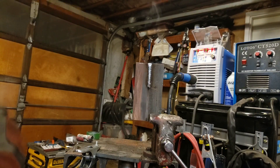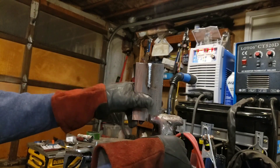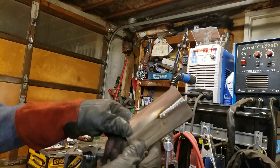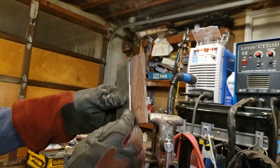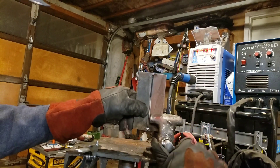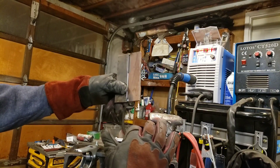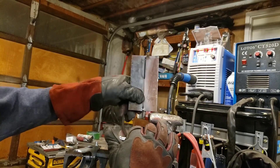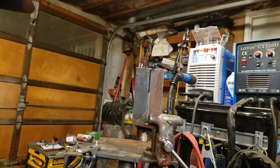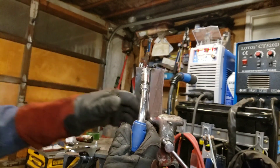That's not too horribly bad. Again, I'm not a professional welder, just been doing it for a number of years. If you can see, it's actually a pretty decent bead. The metal is relatively hot — you can see some pretty decent discoloration. This is set at 140 amps, 19.1 volts. It sounded good — let's try it again.